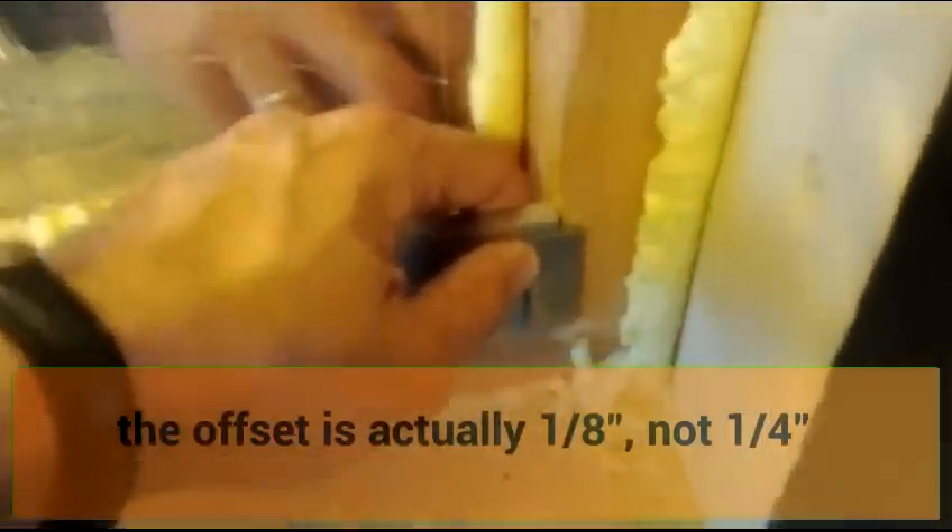Here's another snug fit, this one on the left side. I'm going to attach the left and right ones with pocket screws — nothing too complicated. Then I'll make the top and bottom ones, and I'll size their length to the left and right ones once those are installed. When installing the extensions, I use these slide rule things to mark off a half-inch reveal. I make a handful of pencil marks up and around the window and simply hold it to the line by eye — one hand holds it in place, the pocket screw goes in with the other, tweaking it in and out.